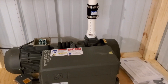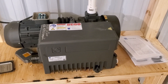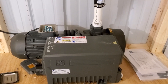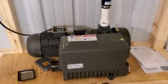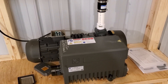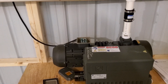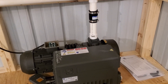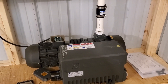On this pump, it likes to run warm — we like to keep it at 160 to 170 degrees. Get yourself a heat gun, shoot it, and figure out the temperature on this pump. The reason we run it so warm is because if there are any vapors that get through the moisture trap and get into the oil, that will burn the moisture out of the oil. That's why we like to run them hot.